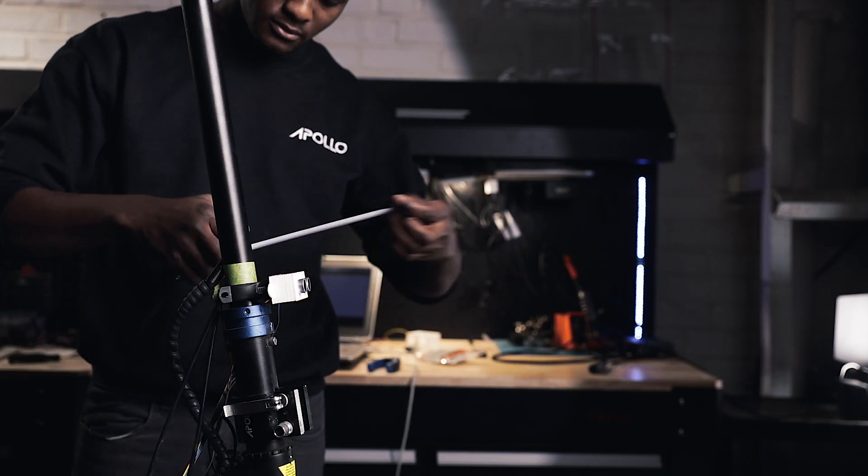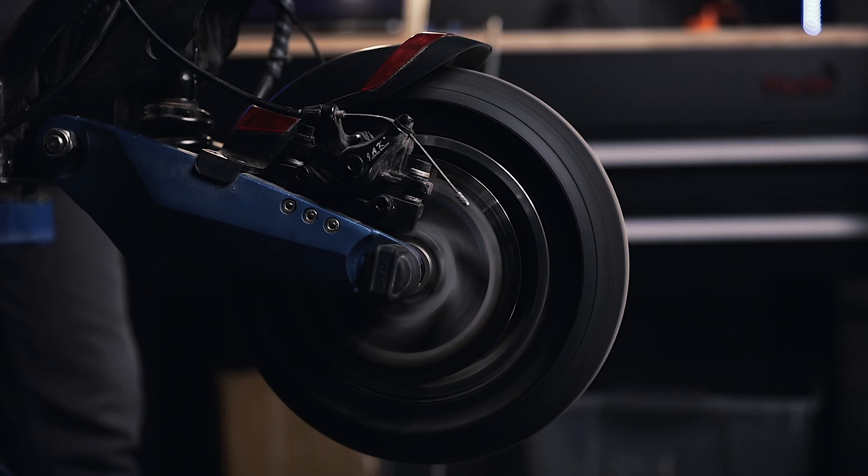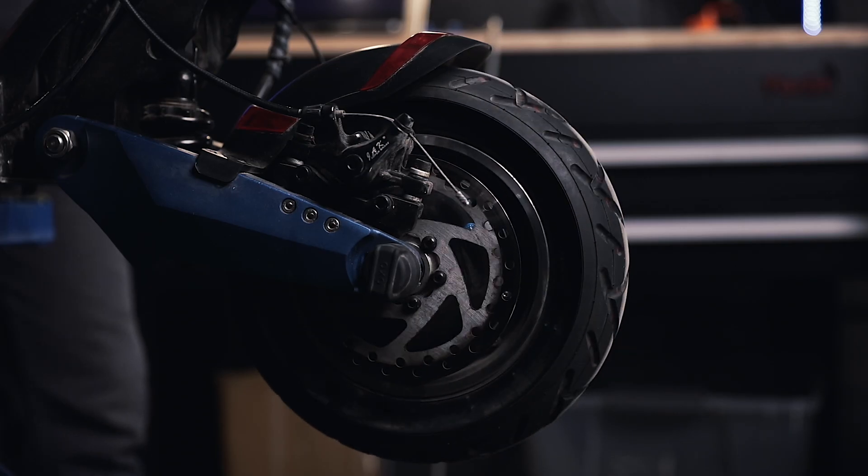Now that I had the equation, I had to program the Arduino to cut off the power going to the motor whenever an object was detected in front of the sensor within a range of two centimeters up to 400 centimeters. I hope you guys enjoyed watching my R&D project.